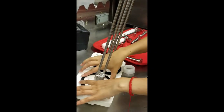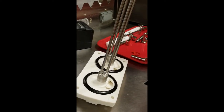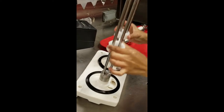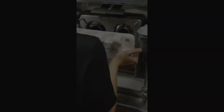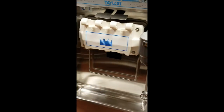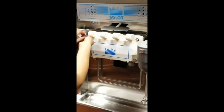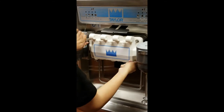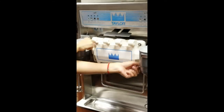Place the large black rubber gaskets into the grooves on the back of the freezer door. Then place the white plastic bearings over the rods with the wider bottom resting against the freezer door. Place the freezer door into the center of the beater and make sure it sits flush against the machine wall. Place short screws on the bottom and long screws on the top, and tighten in a criss-cross pattern to ensure it tightens equally.